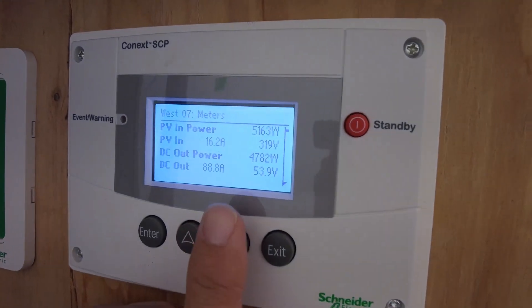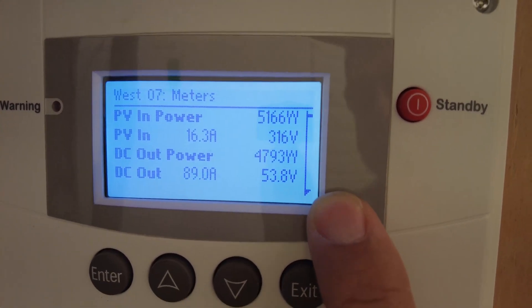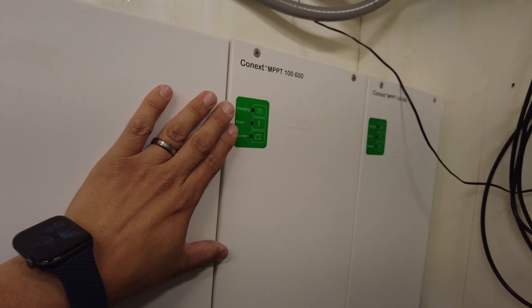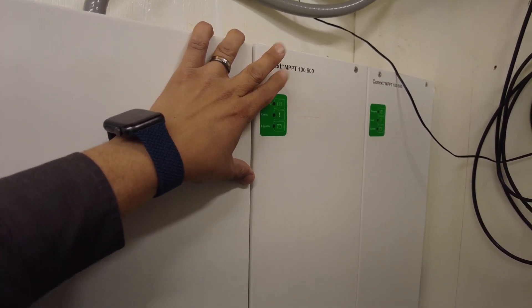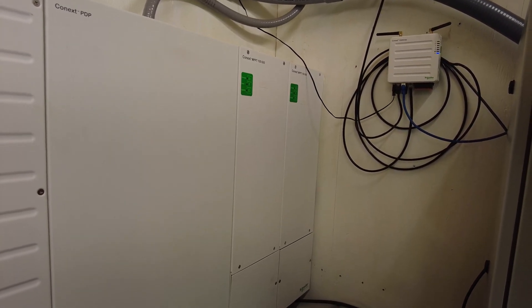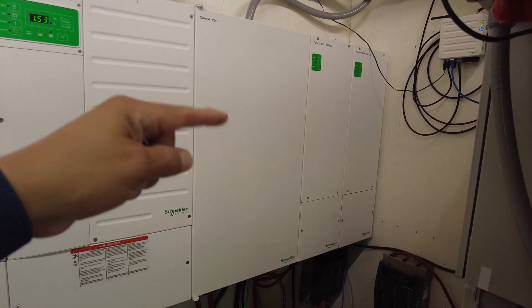This is where I should talk about overall system efficiency, because a lot of power ends up going down the drain. The big loss is the charge controller efficiency: looking at the solar charge controller serving the west bank, 5,165 watts going in and 4,790 watts coming out — a reasonable amount of loss given off as heat, because inside these solar charge controllers we basically have inverters and rectifiers. The DC comes in, gets inverted to AC to change the voltage, then rectified back to DC. When both charge controllers are at maximum output, the loss is around 800 watts total — at least two full solar panels just being burnt on the fire of inefficiency.